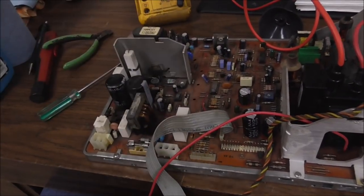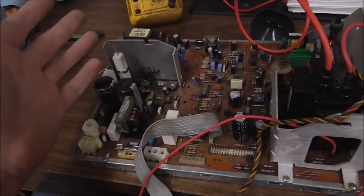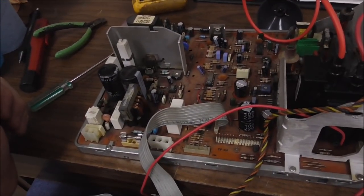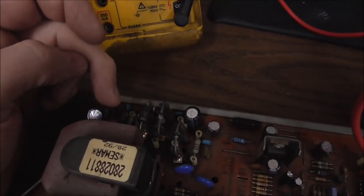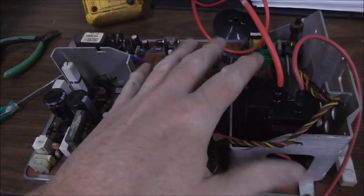But it takes a little bit to hook it up and it's kind of a pain. So I always prefer just finding something with a multimeter. I can't find anything shorted on it. So the things that you want to check are these diodes back here. There's four of them that are basically on the outputs of this transformer. This is in the power supply. Then the voltage comes over here and starts running the deflection.